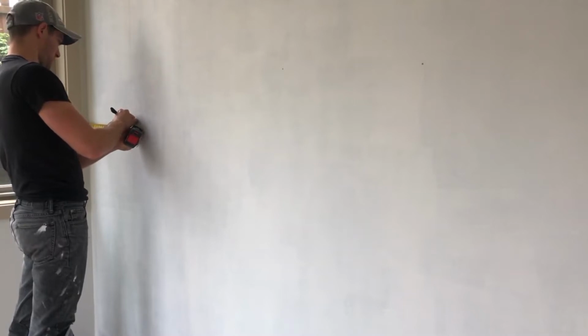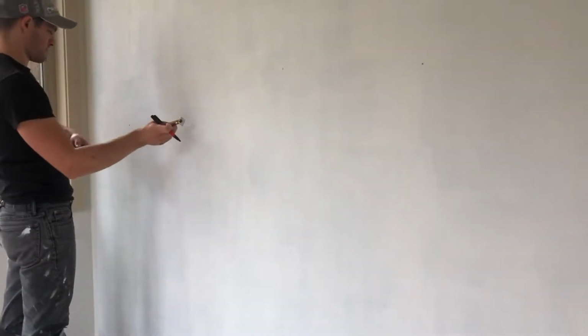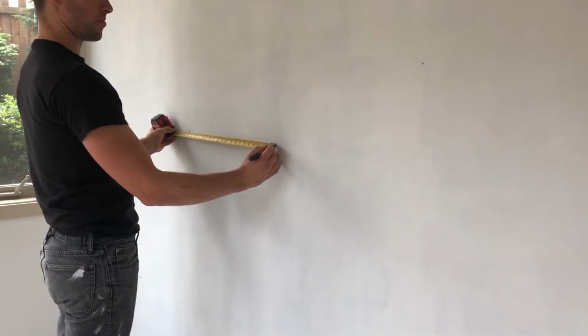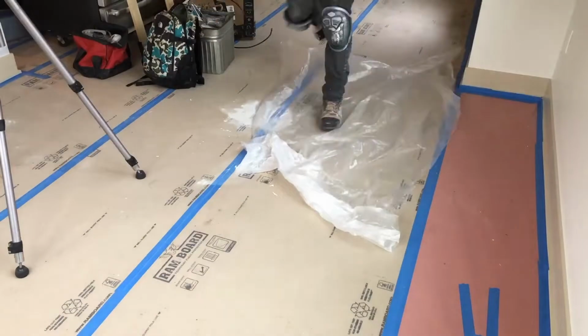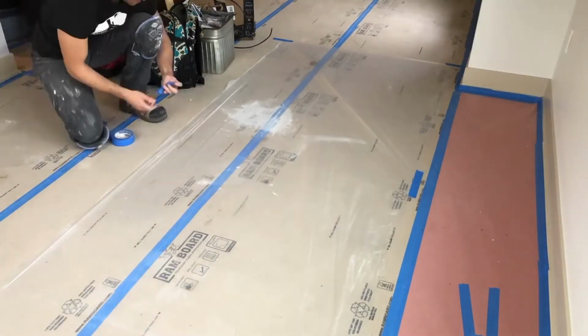I had to purchase 2 for this one wall because each roll comes with 56 square feet and I had approximately 100. Now I do a general layout review just to see approximately where the panels of the wallpaper will be placed, and then proceed to prepping out an area for cutting and spraying the wallpaper prior to installing.